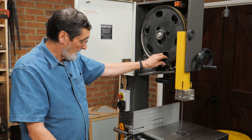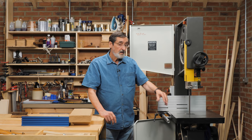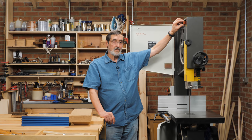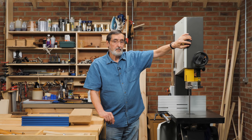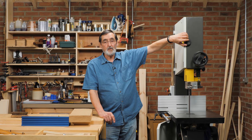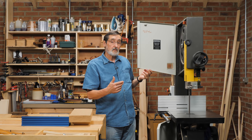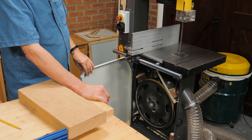So I've got cast iron wheels, a good sturdy frame, and something that's not vibrating all the time. I've got a cast iron table that adds weight and body to the whole machine and gives it a certain rigidity that I like. On my doors, I've got magnetic switches top and bottom. If I open the door or if it springs open without being properly fastened, the switch will automatically switch off the machine and shut it down as an emergency stop. I can't open the machine without switching it off — accidents happen.